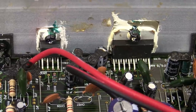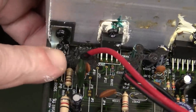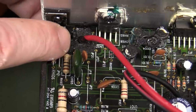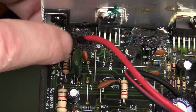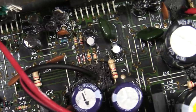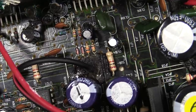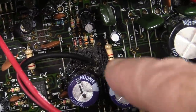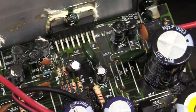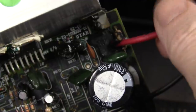Those single in-line package power amps — as I said, they're not using discrete transistors in there. Look at this: this is our tweeter amplifier based on the wiring, and the fact that the tweeter will be less power than the woofer — bi-amplified, separate amplifiers for each. This seven-pin package down in there would be the tweeter amplifier. But look at all the black gunk down in there. There's a poor little resistor under there. I'm wondering if this black gunk has become conductive.